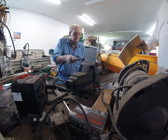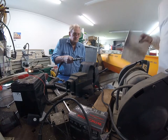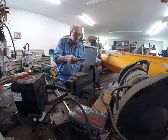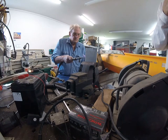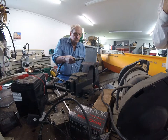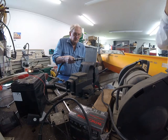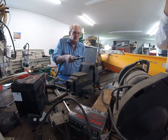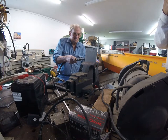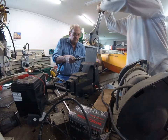So this is going to be one of the base plates in the bottom of the boat — this is kind of the front part of the frame, and that's for the rear part of the frame. Steel you can tell when it's ready to bend because it will turn red, but aluminum doesn't do that, so you just have to keep testing it. It's very easy to get it too warm and melt it.